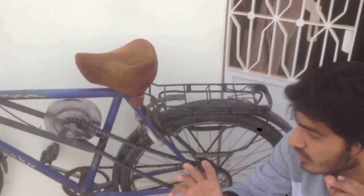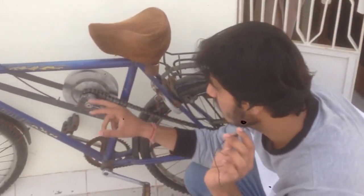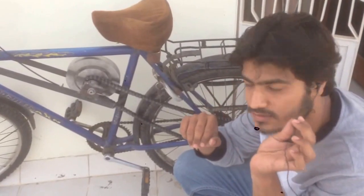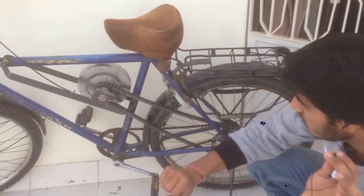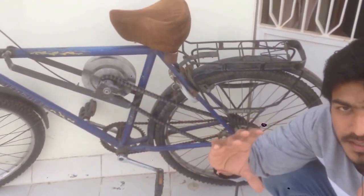In conclusion, we learned that if this system is applied on bicycles, the movement gets convenient after reducing speed — when we want to increase the speed again, this system helps in the smooth movement of the pedals. We also conclude that if improvements in the design are made, the efficiency and effectiveness of the system can be increased. For example, if the clutch plate arrangement is replaced with a two-sprocket system, the system becomes more effective and the efficiency increases.